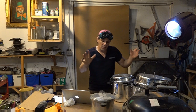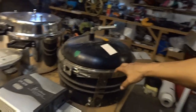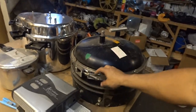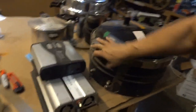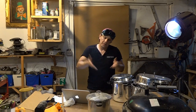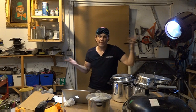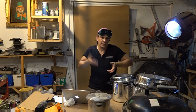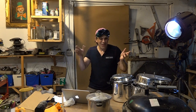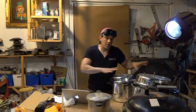We have vacuum chambers of all shapes and sizes around here that we use for different purposes — from very small pressure cookers to larger ones, all the way up to a mega vacuum chamber that can hold like 150 pounds per square inch of pressure. We use them for resins, to degas them, or for different things. You can buy a lid for a five-gallon plastic bucket for simple resin degassing — it works okay — but the dedicated chambers are the best bet.